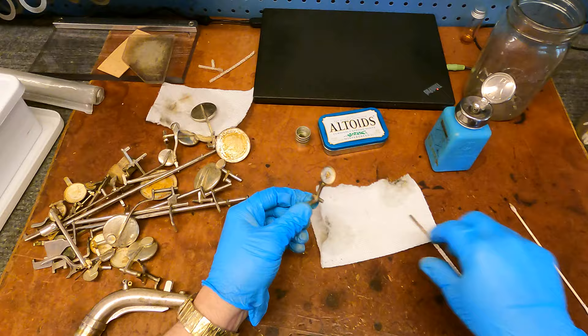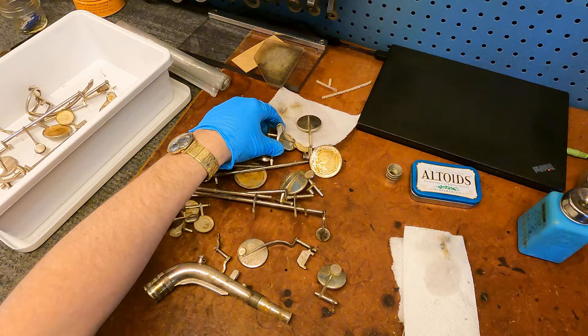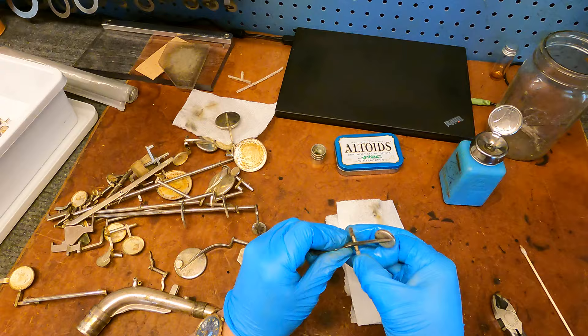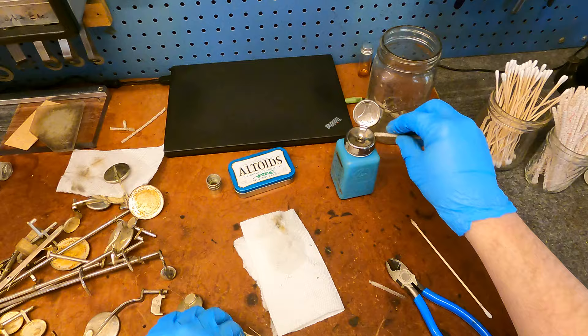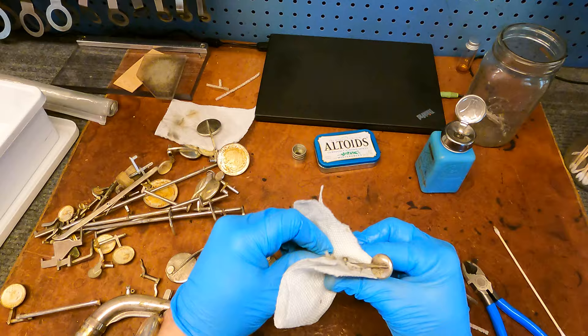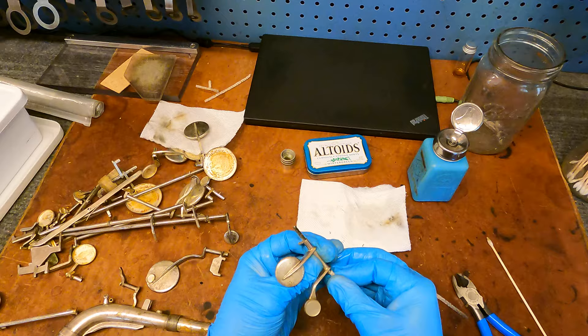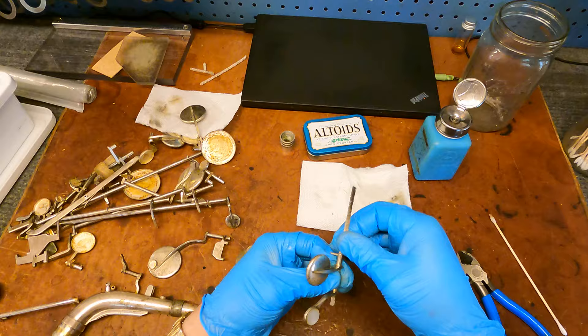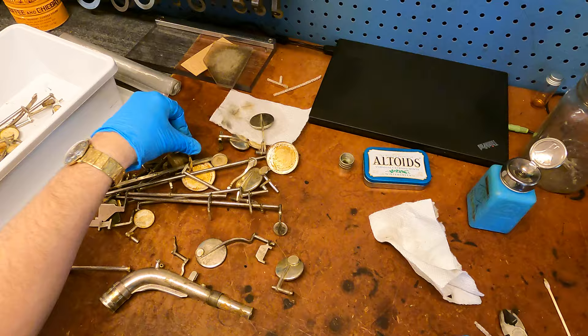This process is also part of a clean-oil-adjust, which you may have seen in a previous video. For me this is the starting point for any job where I need to clean at all. Even when I take instruments apart partially, I'll typically do this to get out the old oil — no reason not to, it just takes a minute. So when I put it back together I'm not reintroducing grime and grit. If you take off a stack and are redoing a bunch of stuff, cleaning the hinge tubes doesn't take that much time compared to how much you're already spending, and it seems like a worthwhile expenditure.